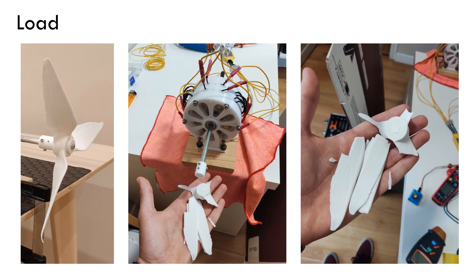In order to get the most out of the motor and to bring it to its maximum performance, a significant load torque was needed. In this case, I printed a 3-blade propeller. I took the 3D design from the internet and adapted it to fit the shaft. It was printed in PLA, which has worse mechanical properties than PETG. The torque that the propeller had to withstand at 7000 RPM was too much and the consequences were quite catastrophic. I believe it is important to add these images to show that care must be taken when operating 3D printed electric motors at high RPM. In this case, I was fully aware of the danger so I was wearing safety goggles and had prepared a cardboard barrier to stop flying pieces.